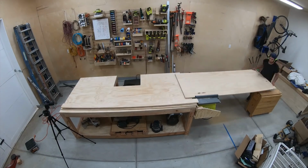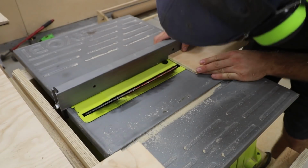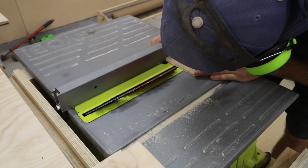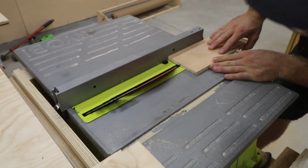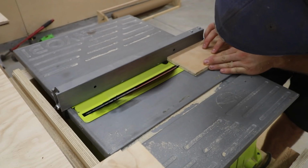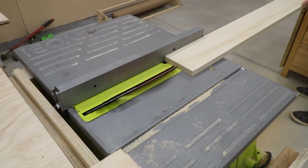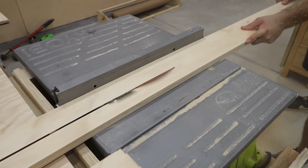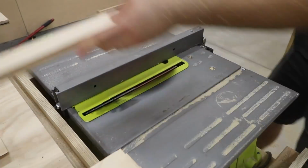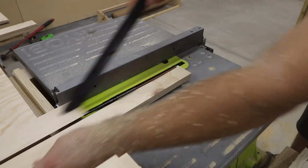Then I needed to cut these 8 strips in half with a 45-degree angle. I used a scrap piece to trace a mark from the existing French cleats and set the fence. But another trick would be to guesstimate the fence, cut a small notch on a 4-inch piece, then flip it over and see if it lines up. If it does line up with the cut, then you're golden. If not, then adjust accordingly. I ripped all 8 strips to create 16 full-length French cleats.